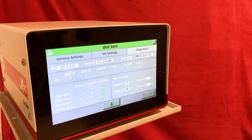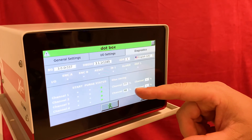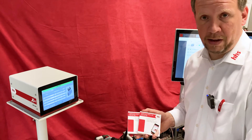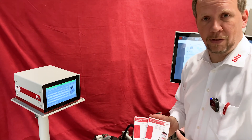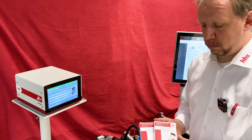Now our dot box, placed between the HMI and the applicator, is changing from line to dots. In our diagnostic tool, we show directly how much glue you are saving depending on the dot distance and the dot size. As you have seen, with the dot box it's possible to change from line to dot mode with electronic or pneumatic applicators. We have adapted the Tesla in the dot box kit so that it really makes sense to run your production with an electronic gun and our dot box.